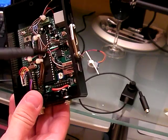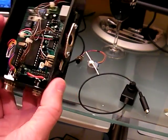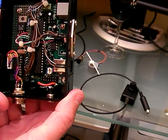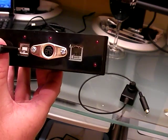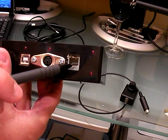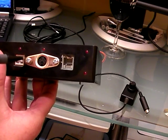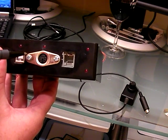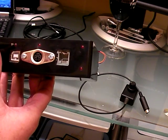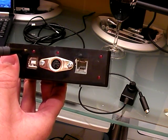This chip here is the RS232 driver — I'm not using that; I've removed the RS232 socket so it's essentially redundant and I've disconnected the power for it. This development card has a USB socket built in, and also a standard PIC programming socket. The socket in the center is for the manual focus controller.